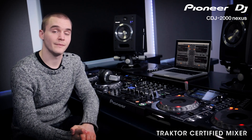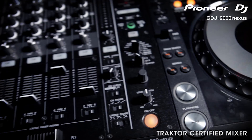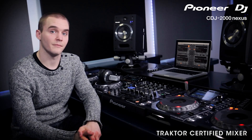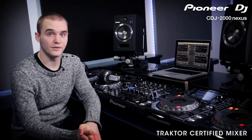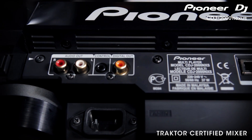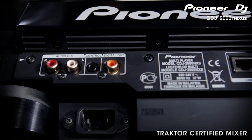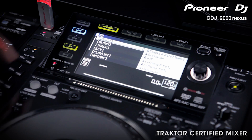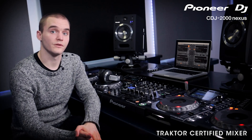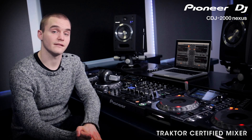This can be done in three different ways depending on the equipment you have available. One, we highly recommend you use Traktor certified mixers like the DJM900 Nexus and the DJM850 which have built-in sound cards — this is by far the simplest to set up and you don't need to make any extra audio connections. Two, if you don't have a Traktor certified mixer, you can use the CDJ's built-in sound cards — the most convenient option since the sound comes through to the digital and analog outputs on the CDJ, already wired up to the mixer. Finally, you can use any sound card and connect just the outputs to any mixer in the normal way.